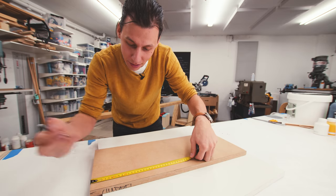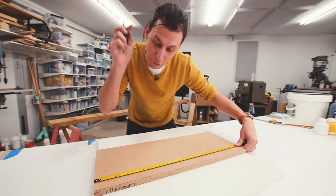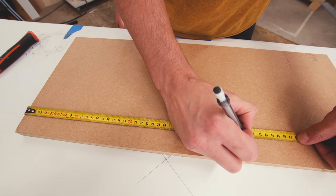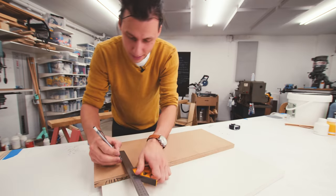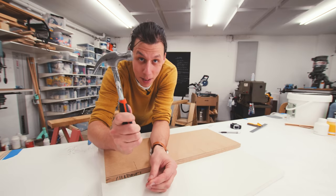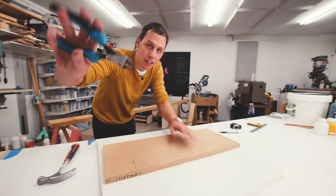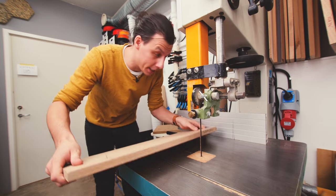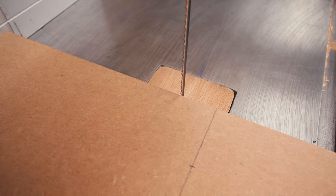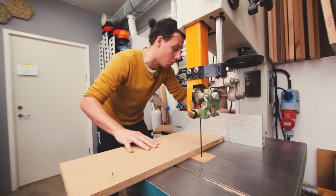This is how it works. You start by measuring out some random distance away from the side — I'm going to do 10 centimeters. Then from that mark, move over the same distance as the radius of the board, which in my case is 295mm. Make some square lines, mark a random distance in from the top — let's do 5mm — hammer a nail into the first mark, cut off the head of the nail, and then over at the bandsaw, set the fence so it lines up with the line we made on the MDF, and cut along that line until we get to the mark.